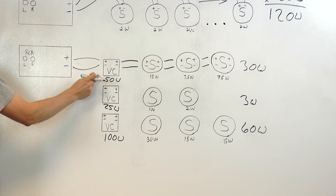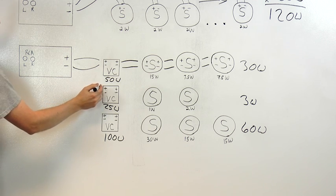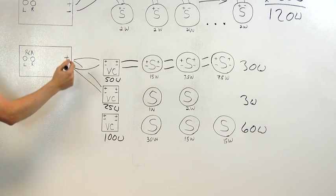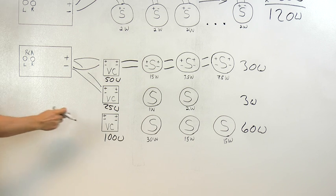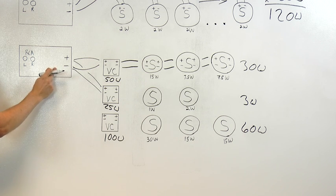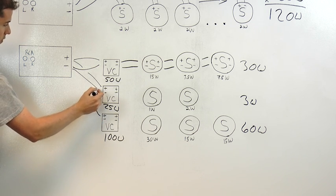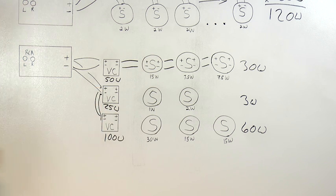Now that we've determined the size of the volume controls for zones 1, 2, and 3, we need to wire up zones 2 and 3 to the amplifier. This can be done one of two ways. Running in parallel, you can run the zone 2 volume control and double up positive to positive, negative to negative on the amplifier — this is great if the volume control is close. However, if your volume control in zone 3 is far away from the amplifier but close to the volume control in zone 2, you can simply go positive to positive, negative to negative on the input side of that volume control, drawing power from the amplifier.